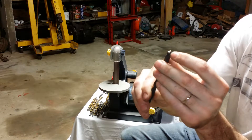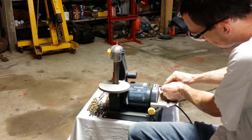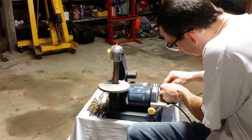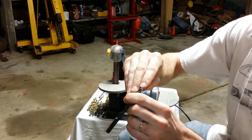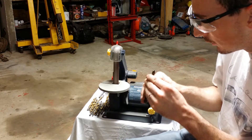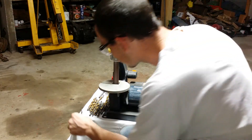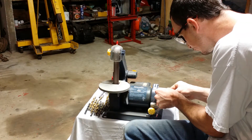Here's how you would take that flute down. This does look better on the edge grinder, but you can go like this. You want to make sure that when you're doing that you're not dinging up your new edge, because this is the cutting edge and this is the back edge. Once you do that you can go back over it a couple more times, and then you'll have a nice clip on there.